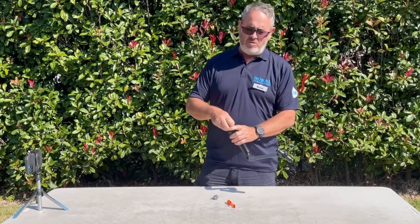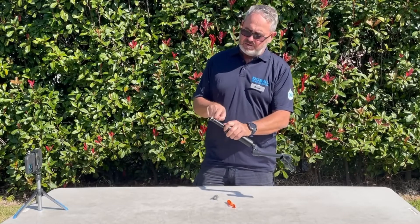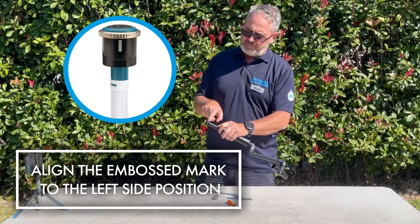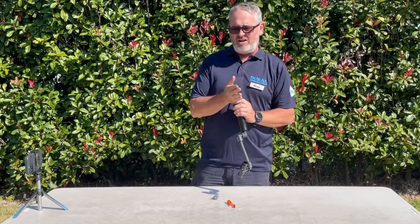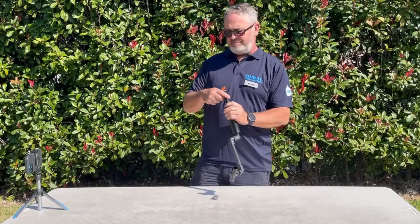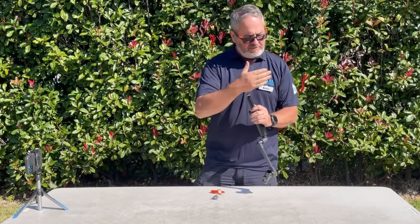Now when you turn it back on you'll see that it'll pop up and it's probably facing the wrong way. You need to rotate the shaft of the pop-up around so that the embossing on the left side of the MP rotator head is at its left-hand position, because that's fixed — we can't adjust left, we can only add or take away right. With it running, we can turn the whole shaft around — you can hear that ratchet mechanism — to line up our left.